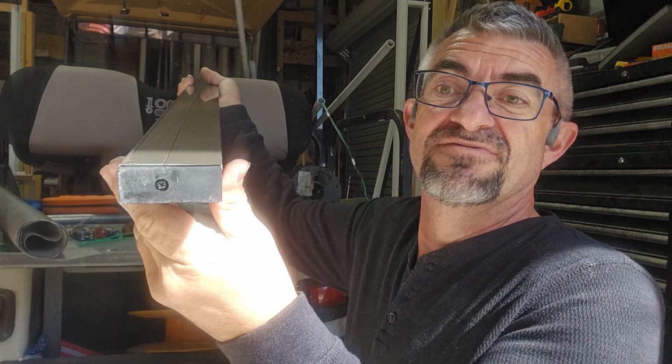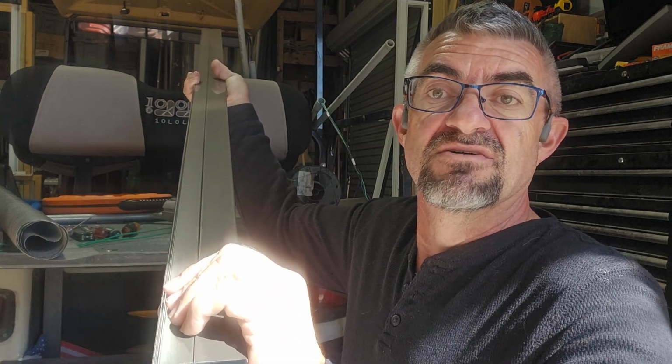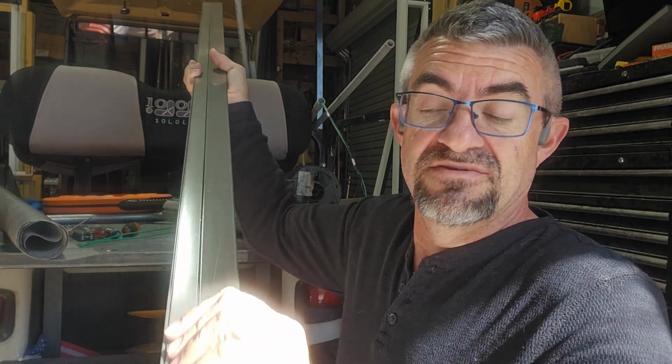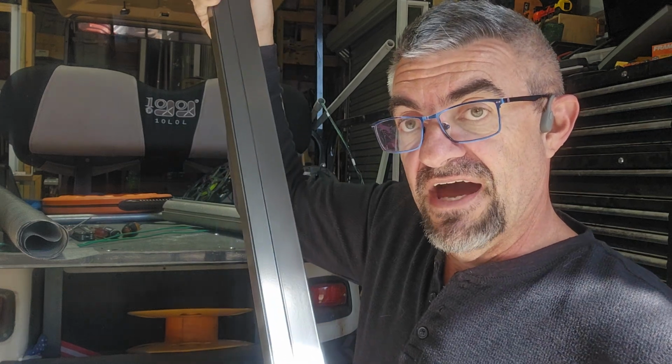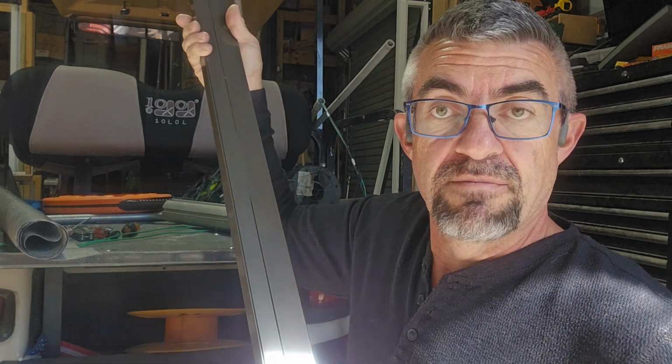Now, when you go out for a service call or when you cut the tracks off to size, sometimes it's hard to get the cap off. Now, each color is a little different. I know the textured colors are a little harder to get off. Usually whenever I cut it at the bottom, you can slide the track out the bottom when you take the cap off. As you can see, you can slide this out. Not always does it slide out. I've taken it, tapped it until I got it loose enough so I could slide it out, or pushed it, tapped it with a hammer or something like that.